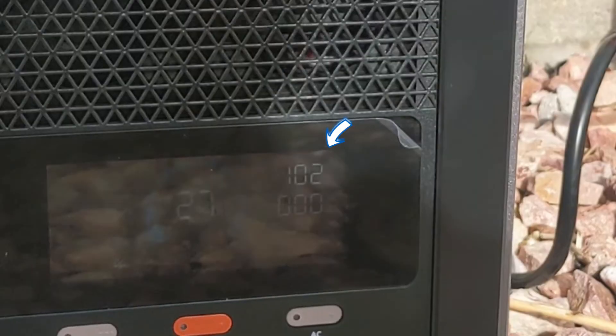Two days is pretty good. Charging your phone, running a light, and small things around — definitely not a problem. And if you're smart, you could put two of these solar panels together. Even though they are 200 watts combined, the power bank is limited to whatever it can handle, so you're not going to burn it — I know because I've tried it with a bigger panel. It charges at 105 watts, but that's the max it can accept, and at that point you will charge it in one day. Now you're armed with this information — I hope this video helped.